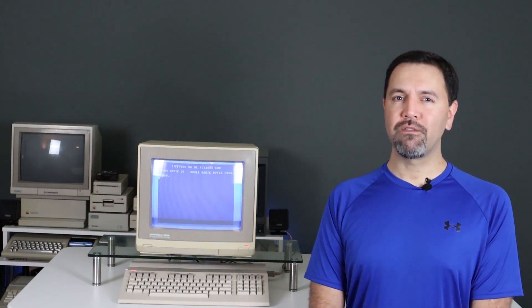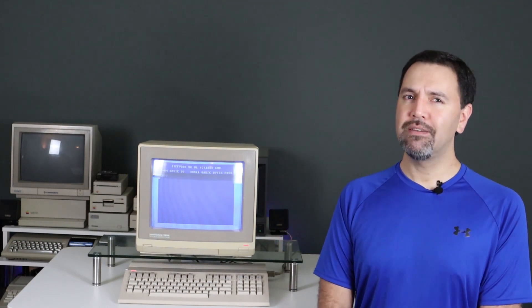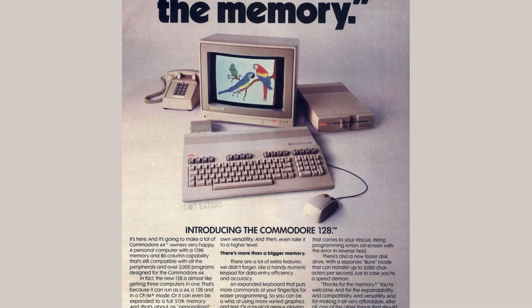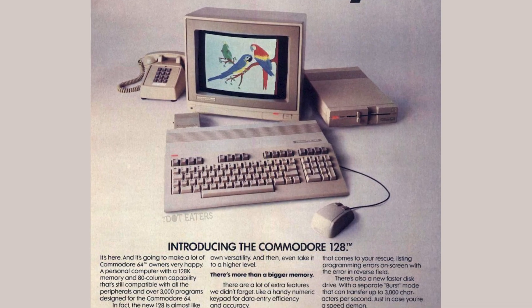While apart, we'll also modify it for analog RGB input, perform a quick retro bright treatment, and take a look at some vertical stability issues. The 1902 was the earliest monitor produced for the Commodore 128 that supported the new 80 column digital RGBI mode for the NTSC market.